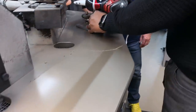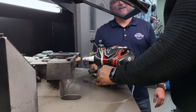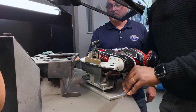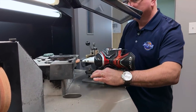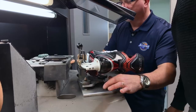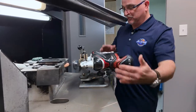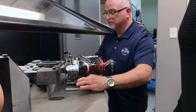Center the stone, fall in — yeah, you see what I mean? There you go. Follow through and then turn. Keep it at the center of the stone — that's where your contact is. I'll steer and rotate up. You're following the rocker of the blade, coming down center and following through, maintaining contact in the center.